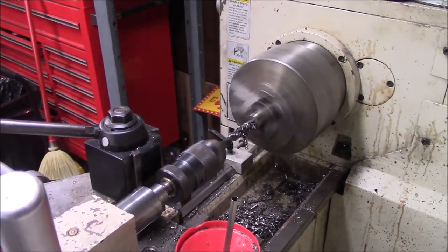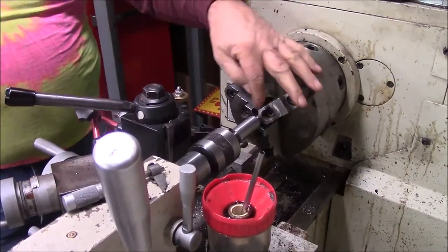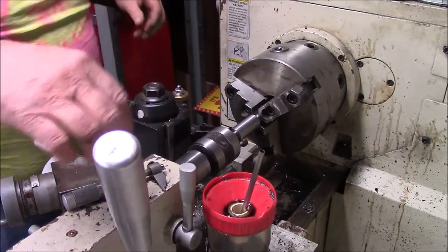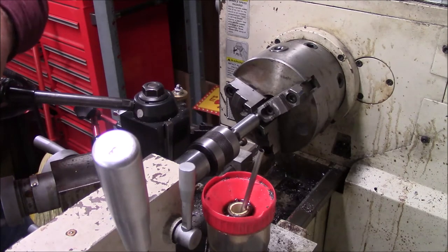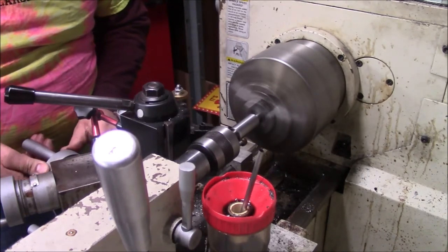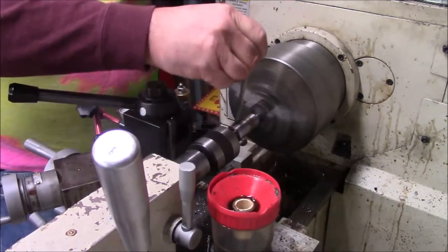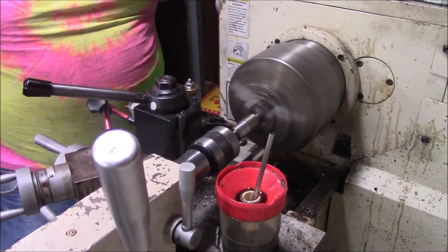I need to mark this before I screw something up. I'm pretty sure it's a half inch. I've got my arbor between centers so I can support it. Right now I'm at about 860 and I need seven — I need 790 or something like that from my calculations. I'll get closer and double-check all this. We're going to take light cuts — the arbor doesn't hold a lot — going down about 20 thousandths at a time. With these light cuts the inserts don't give the greatest chip control, but it's going to be all right.